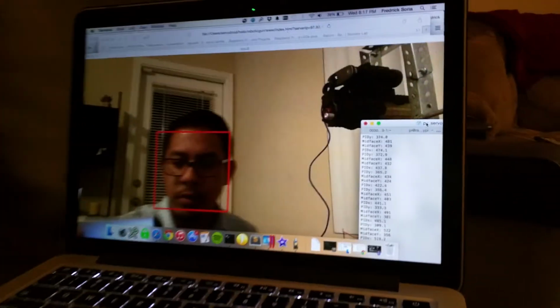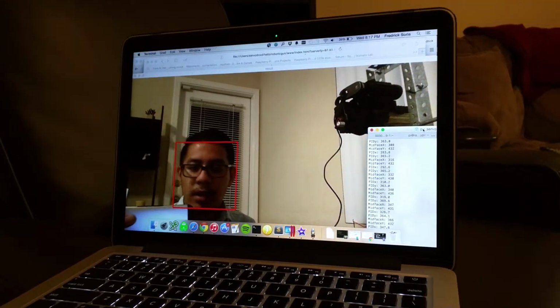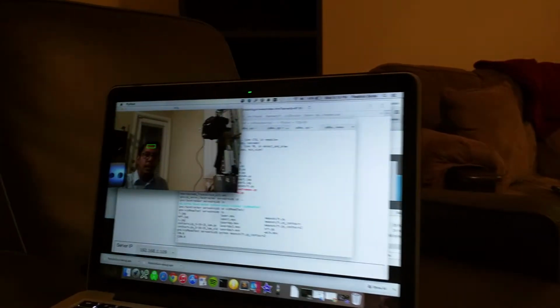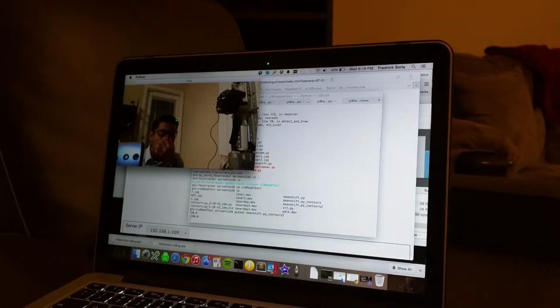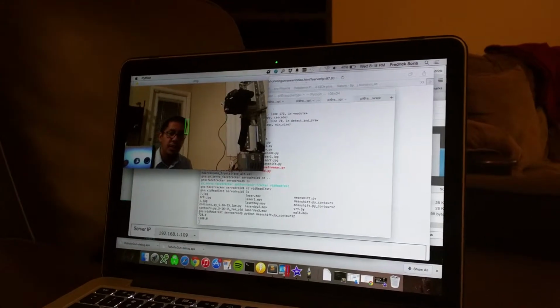Currently the application runs slow on the Pi, and we are going to look at code optimizations to make this faster and run better. Here we made attempts to make the algorithm run faster. The video is made smaller, and instead of tracking the face, it just tracks movement in general.